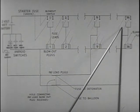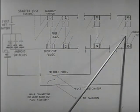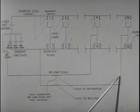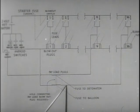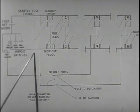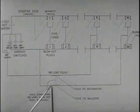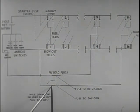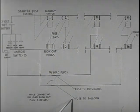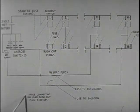The circuits from nine to thirty-six operate the same as one and two, except for thirty-six, which, like number nine, has a double duty to perform: not only are the number thirty-six ballast plugs armed, but also the other payload plug in the center is armed. If all fuses function as intended, the payload dropping will be controlled by these aneroids. When the plug blows, a fuse to the magnesium flash charge on the balloon is ignited. A flash hole connects the payload blowout plug recesses — should either plug blow, the other will be ignited and both fuses will function simultaneously.